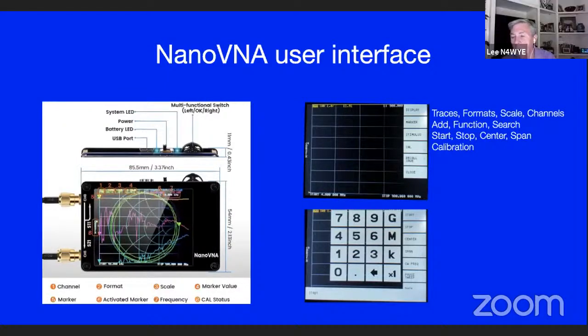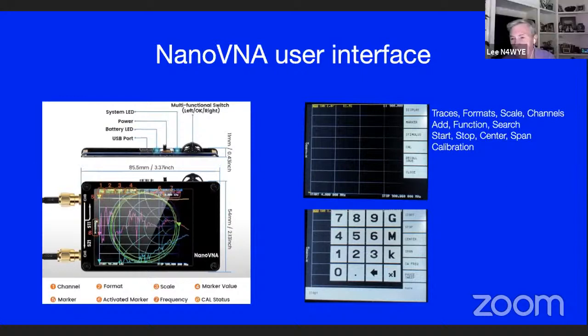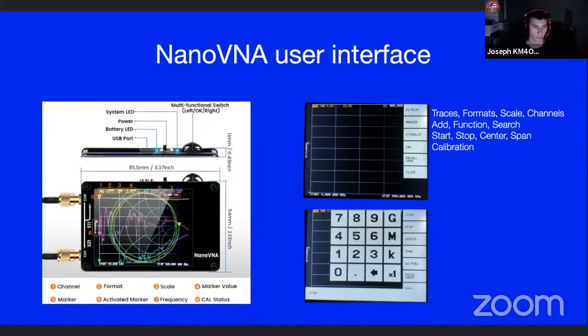Before I'd trust it, I'd at least make sure on 50 ohms that you got a shot. Get a 50 ohm non-inductive resistor and try it. Then at least you've got a first order approximation that it might be good enough to squeak by. Certainly you'll be able to tell what the resonant points are on the antenna frequency wise, so you can just tell where minimum SWR is.